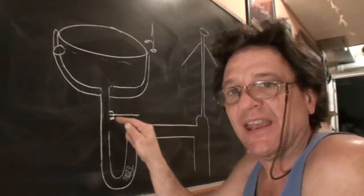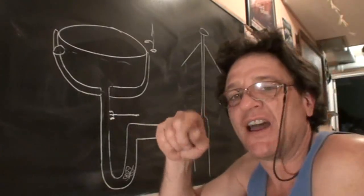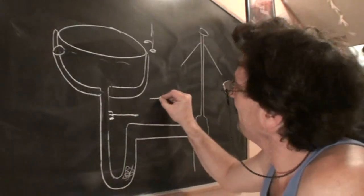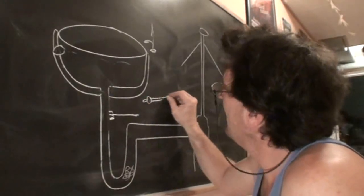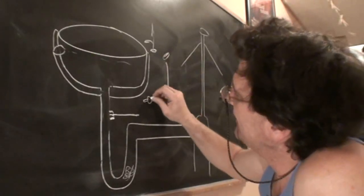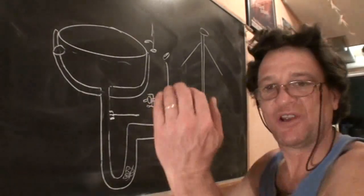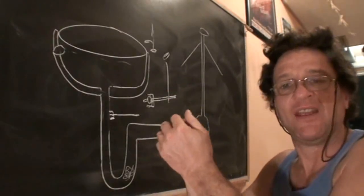And when you put the pop-up arm back in, make sure you pay attention when you take it out, because there's usually a little nylon washer kind of thing, because there's a ball. The pop-up arm has a ball, and this is the outside where the handle hooks up. This is that ball where the nut is. So you want to put everything back the way it came out. Sometimes there's two clamshell things, sometimes there's one clamshell thing.